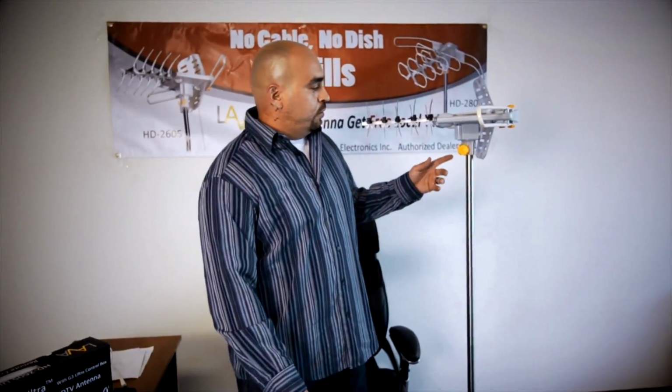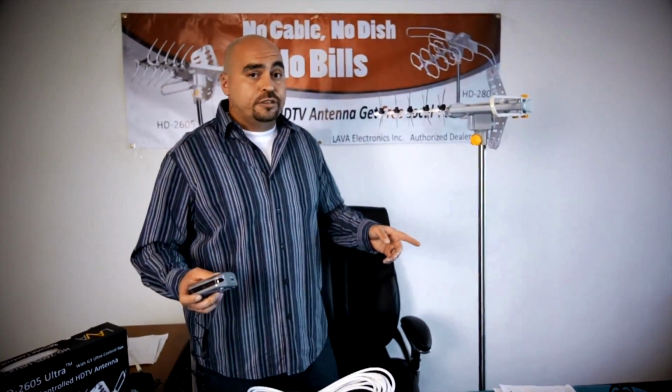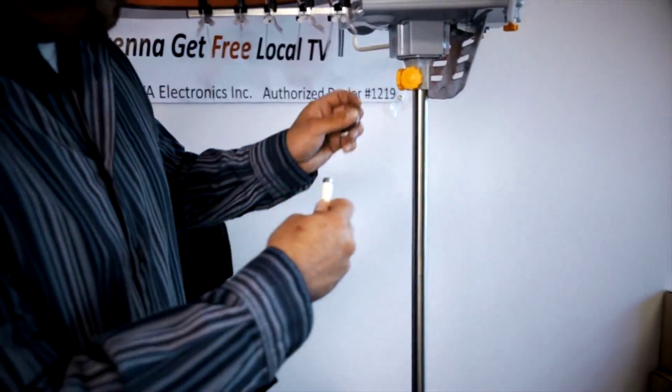When you do connect the antenna and install it outside, I can't stress this enough, make sure that there are no F2F couplers running between the antenna coax cable and the control box. There shouldn't be any splitters, no grounded F2F couplers, or any kind of amplifier device, or you will render the antenna useless. One solid piece of cable is preferred.